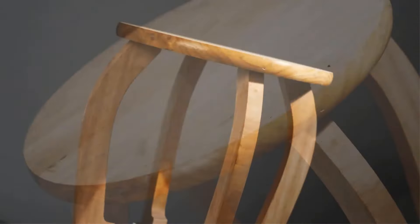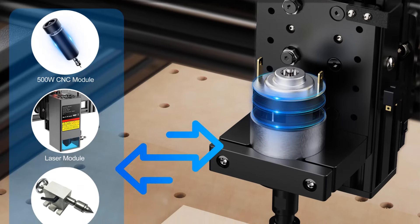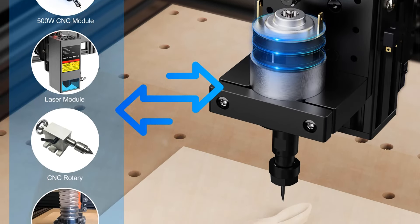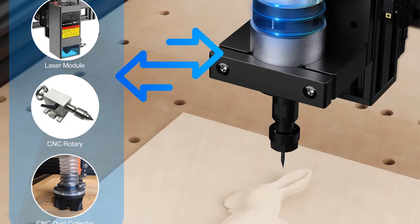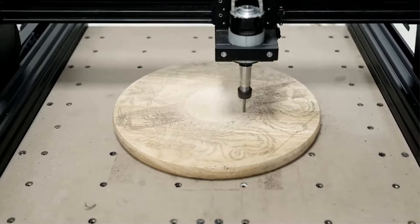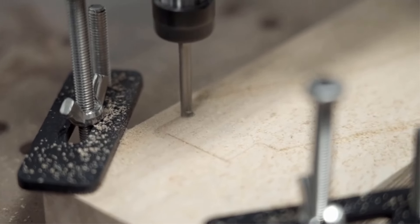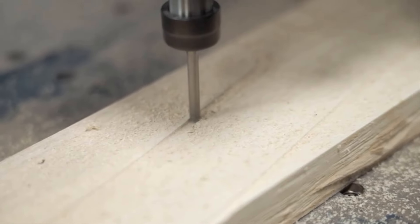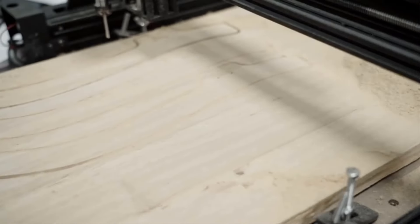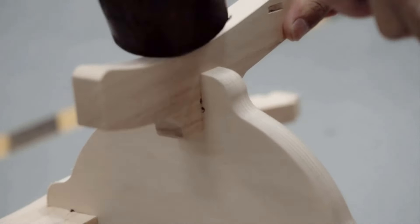The linear transmission mode is a built-in POM wheel and it uses a T8 screw with 2mm pitch lead screw. The Y-axis features double Y-axis with built-in rollers for transmission. The machine supports an emergency stop switch and harness management with X, Y energy chain. It is compatible with CAM software such as Candle and supports programming with Carveco Maker, Artcam, and Easel. The operating systems supported include Windows XP, 7, 8, 10, and Mac OS.